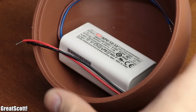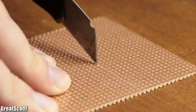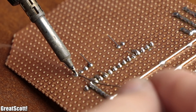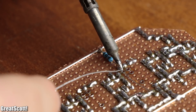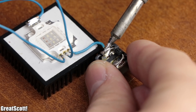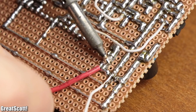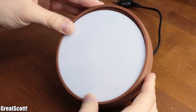I could use the enclosure to position my power supply and LED inside, in order to see how much space I had left for the control circuits. With those reference values in mind, I created a suitable piece of perfboard and started soldering all the components onto it. You can find the schematic and more information about this project in the video description. Once I was close to finishing the circuit, I noticed I was running out of space on the perfboard, so I connected the inductors with flyback diodes right next to the LED. After inserting all the ICs, I did a final successful test, drilled a 6mm hole into the enclosure for the mains power wire, wired up all the components and secured them inside with hot glue.